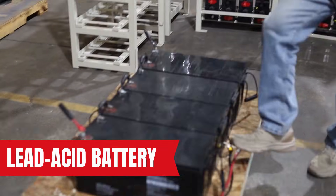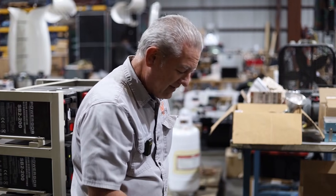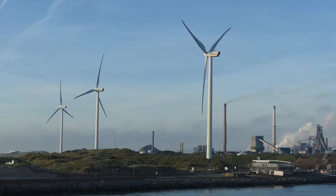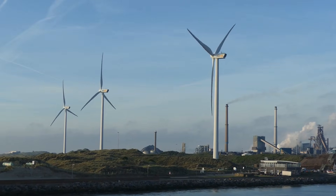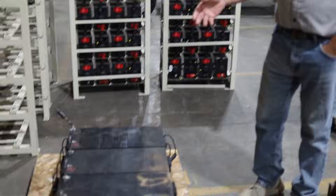What you see here are lead-acid batteries. These are 12 volts and we got them series'd up so you got 48 volts at a pack. The issue with these lead-acid batteries is that they're low efficiency to begin with in terms of what you put into them. From your alternator, wind turbine, or any prime mover — if you're pouring in 100% of your energy, you're only gonna get maybe 70-75% of that energy into the battery because of the battery's innate inefficiencies.